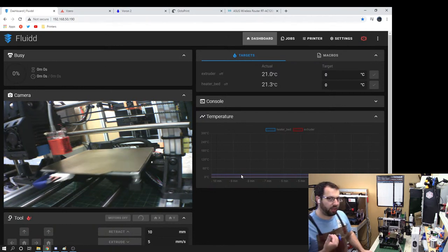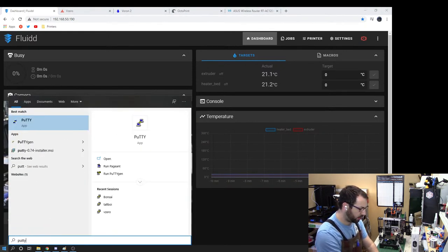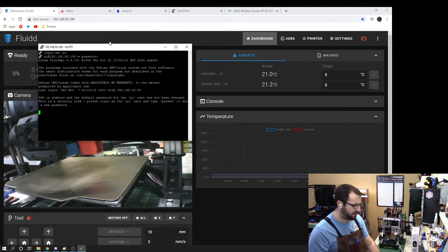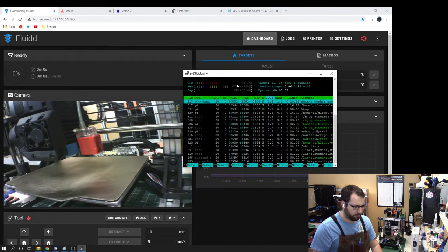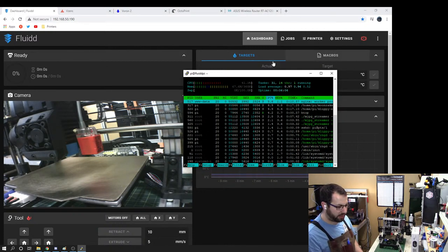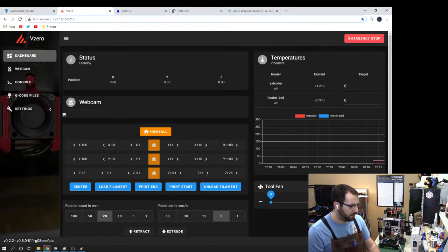But this is lightweight. This is very lightweight compared to traditional OctoPrint. This runs just fine on a Raspberry Pi Zero. And even with a webcam running, let me connect to it here. This is a webcam. It's running at 720p, 10 FPS, I believe. It looks high there at 44, but that's the webcam. If the webcam wasn't running, it would be down in the teens. And it doesn't peak when it's printing. Like, I've never had this max out the Pi Zero. And Core XY going fast is pretty much the easiest way to max out a printer in terms of capabilities. Delta is up there, too. Anyways,